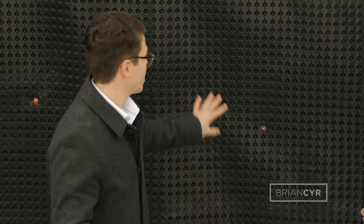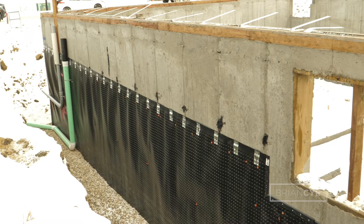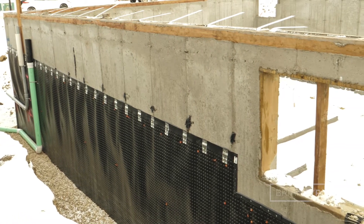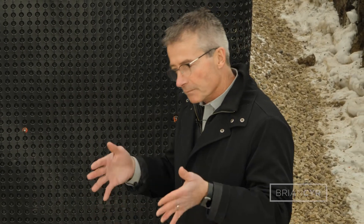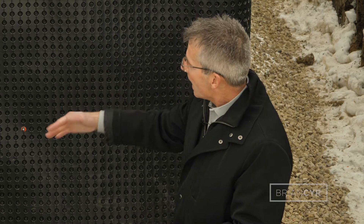What we don't see is actually behind this first membrane here — there is a tar that has been applied to the outside of the foundation to help protect it against that first layer of water. That's very important. Concrete by nature is porous; it is not impermeable to water. So the first layer of waterproofing or damp proofing of a foundation wall is they will spray on a heavy, heavy tar behind this membrane. The idea there is to seal it up so it's impervious to water.